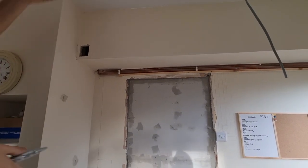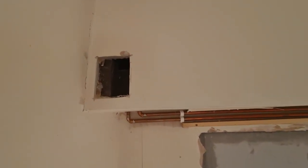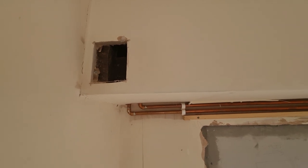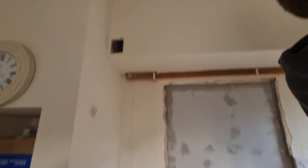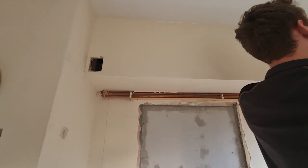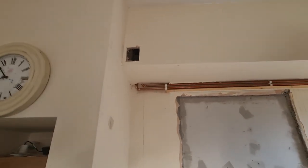This boxing here — we've just made a little hole in the corner so we could see what was in it. We didn't want to start smashing through the bottom without knowing what's there. It's a huge void, just got a piece of timber across — there's no steel in there. I wondered if it was a steel under the stairs or something, but no, it's just a big bit of timber strung across for whatever reason. It'll probably come out, but it's not on the plan so it's staying in. We can draw our cables down the back of it.